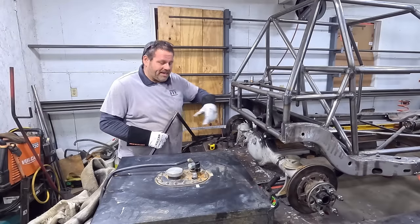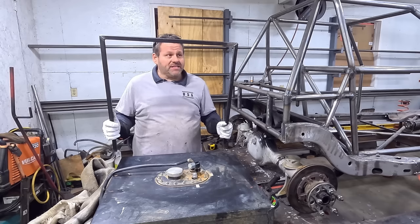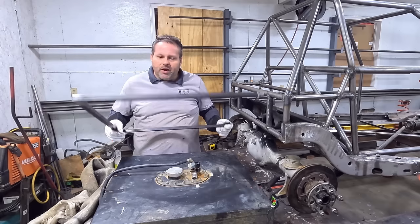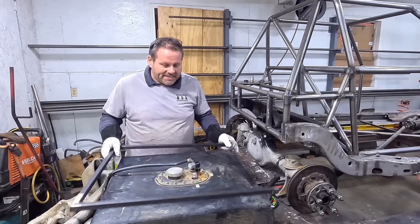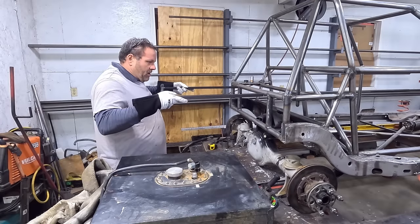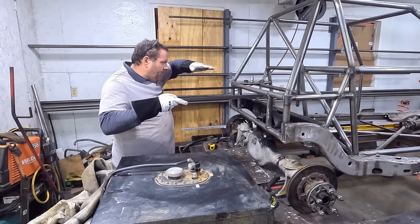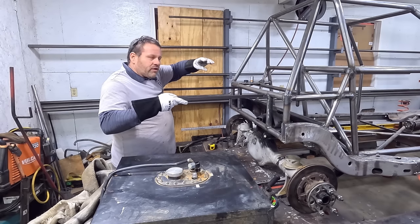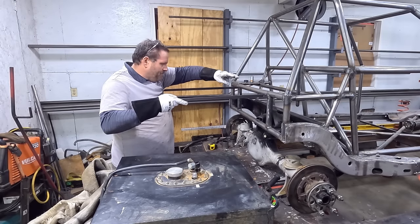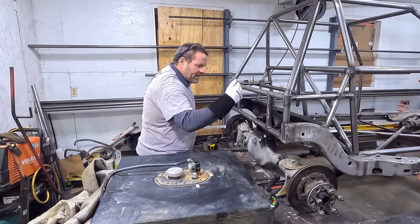We got our two short legs welded in solid, and I've already fabricated our frame for the fuel cell — this is what I'm going to bolt the fuel cell into. It's three-quarter inch square, fits just right around it, and it's going to be under the flange on the fuel cell. The flange of the fuel cell will be right level with the center of that tube. I want the lines and everything on the fuel cell to be an inch or two below the deck — some room in there so fuel lines aren't beating against the deck. That's as high as I can get, so I'm going to flatten these welds off right here where that square tube can just weld up flat.